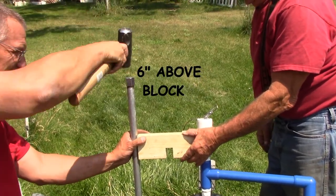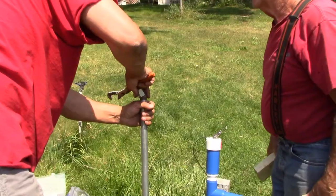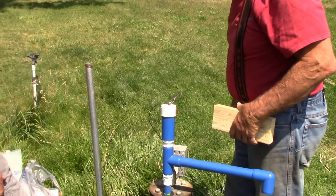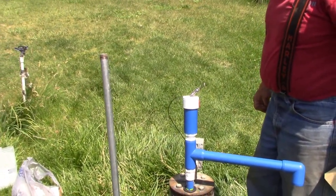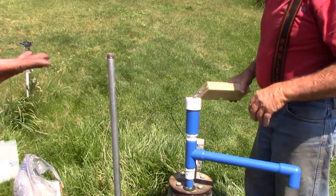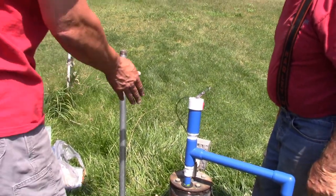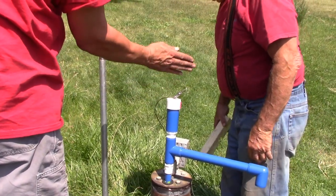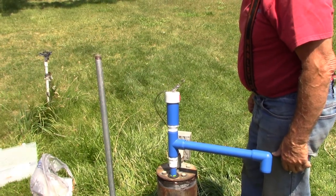It's about 6 inches. How critical is that? Not very. There's a little bit of flex involved here because it's a single articulated lever. If it's double, then you can have something that goes straight up and straight down. That gets expensive real quick. So we have a single one where this will absorb that alignment. So we want it to be aligned when it's down at the bottom.